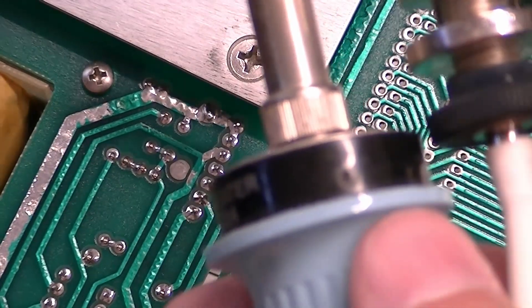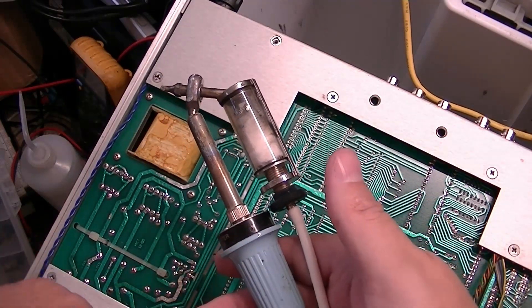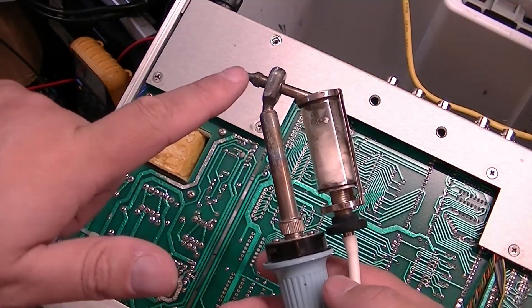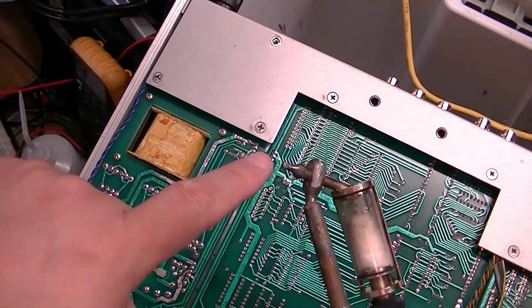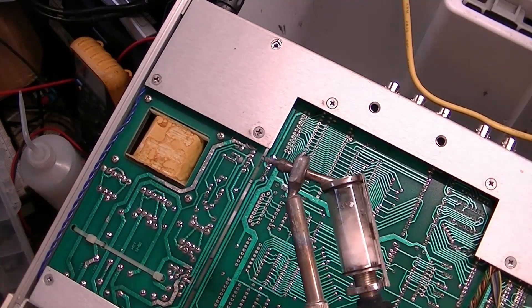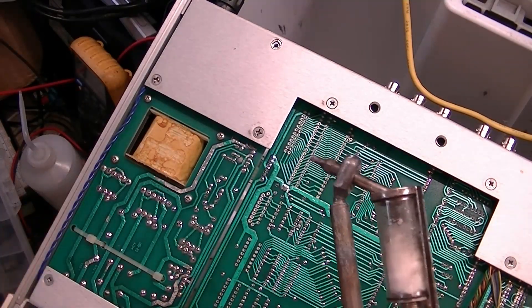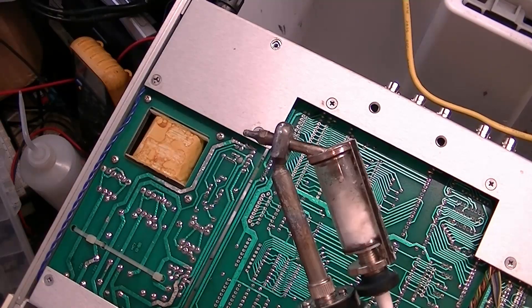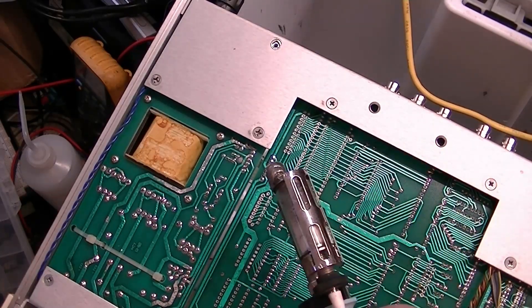This is the business side of the unit — the typical Weller soldering iron handle and heater section, fixed at 800 degrees, with changeable tips of different diameters. One flaw is the solder collection tube is glass, so I haven't found a cheap replacement yet. If you drop it it's probably going to shatter, so be sure you get extra solder collecting tubes to have on hand.